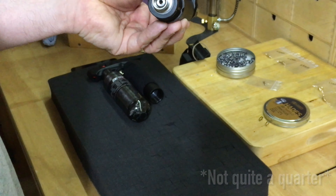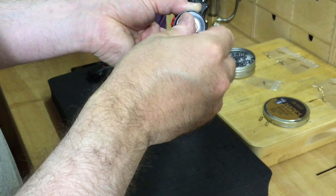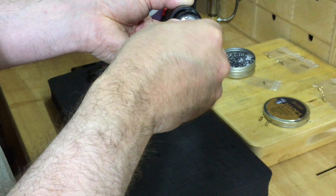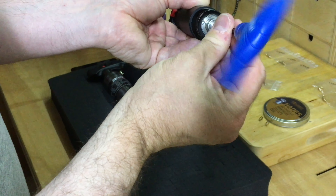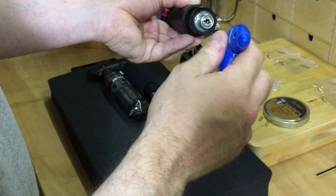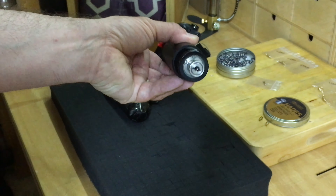I'm then going to put the locking cap back on. Because I'm doing it up and it's a reverse thread, I've got to do it anti-clockwise. Once it goes in as far as I can get it by hand, I then just go in with the Allen key. This is more to protect the thread that can get damaged. You don't go crazy tight — just nip it up and we're good to go.